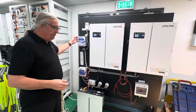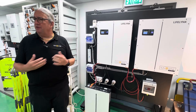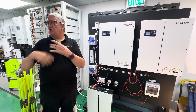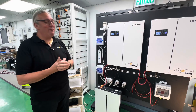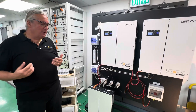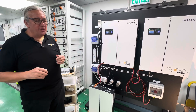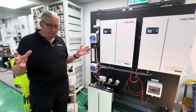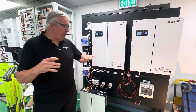If I switch off here — this is the AC power coming in — I can disconnect the AC. You do get a changeover; the changeover is about 10 milliseconds. That's a very very short changeover time. You might see it on an incandescent lamp but if you're running a television you can't really see it, and most inverters work that way.